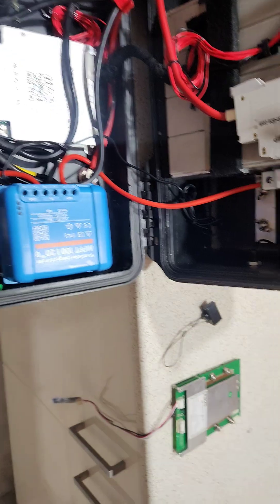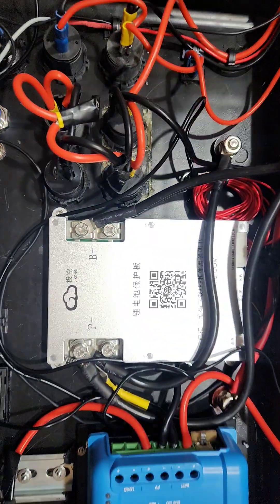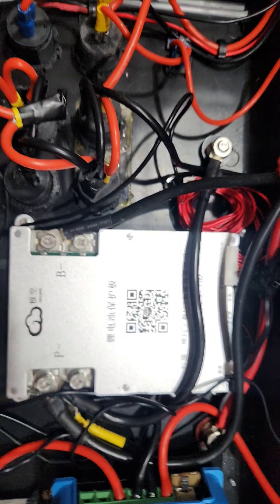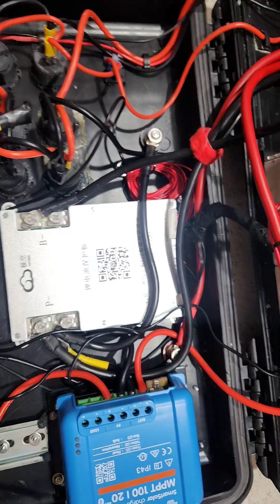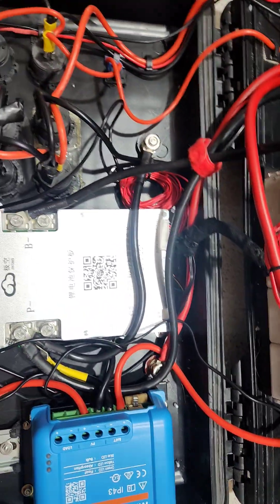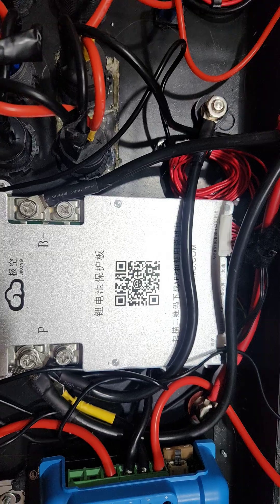If I want to use it in a hurry I just want to get it charged and the cells balanced, so I've swapped that out for a JK 80 amp BMS. It's been a great move — I've just finished installing it, charged it up, and it charges and balances really quickly. It's the one amp balancing BMS.